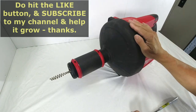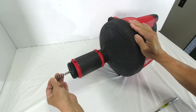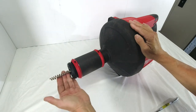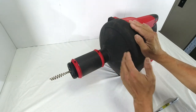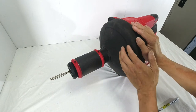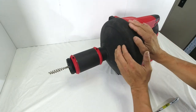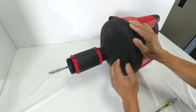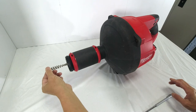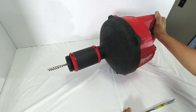When you're at the work site after finishing your job, you may have a chance to use a water jet to clean the extended steel cable. If you don't have that opportunity, you have to retract the steel cable back into the drum, which means the drum will contain grime, dirt, and waste material. Once you get back home, extend the steel cable out completely, jet it with water, and if you have a brush, brush the cable along its entire length to clean it as thoroughly as you can.